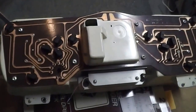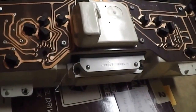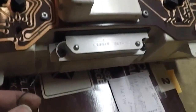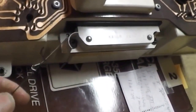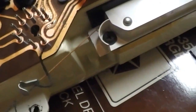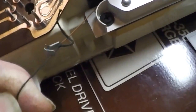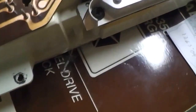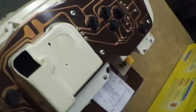Here's the back of the cluster. One word of warning on this cluster: it will not come out until you take the top and bottom cover off the steering wheel column to free up the indicator for park, neutral, drive, reverse. It's on a little spring-loaded thread here, and there's a little tiny metal hook that goes down onto where the shifter operates this little tang. Make sure you get that back right and take it off right so you don't break the string, or you won't have an indicator showing what gear you're in.